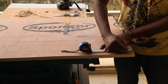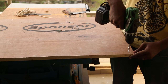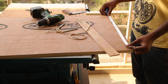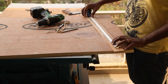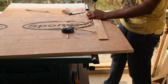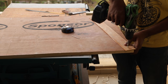To make the unique shape of the leg I need to first draw an arc. I measure one inch from the corner and drive in a screw. I need about five inches on the top of the leg to screw into the sides of the bed, so I transfer that measurement to the plywood. I used plywood because unlike wood this does not have elastic properties. I drill a hole to drop the pencil, then screw the plywood on one end and draw my arc.